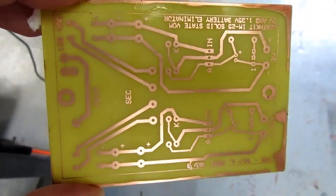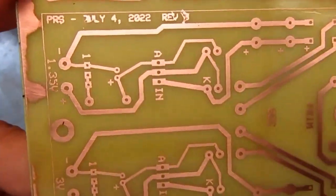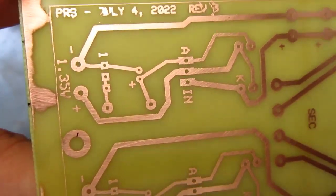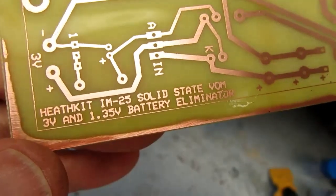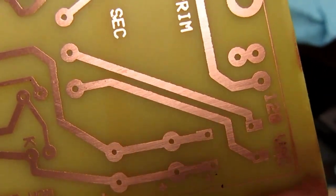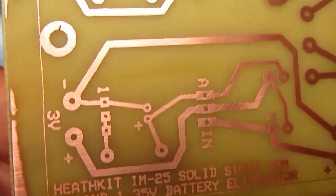Okay, there's the board. Hope if I get it right side up. Again, there's a little bit of a mess up on the transfer up in the text on the lower left corner. This part came out very nice. The foils all look pretty good. There's a little undercutting along the edges. But unlike when I did this before,